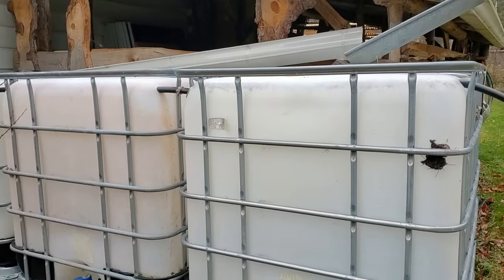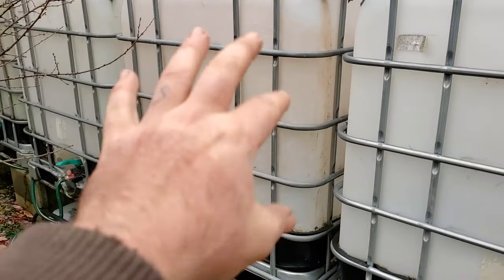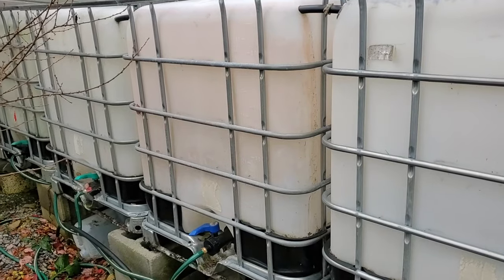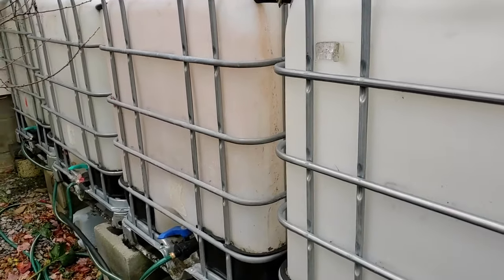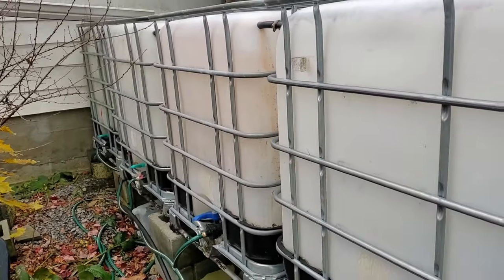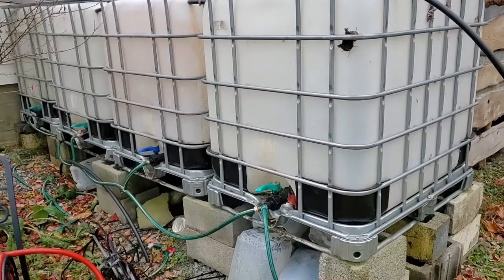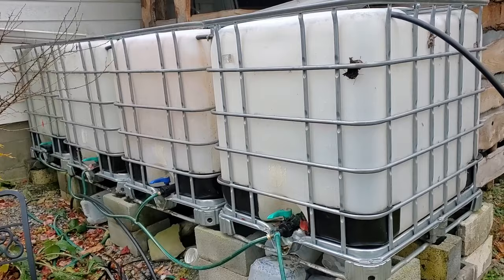We get very cold here. We do not want to have water stored in these cisterns. They can technically take being filled with water and freezing solid and not necessarily be killed — I've seen that happen, I've made that happen unfortunately. It swells the metal. Sometimes they break at the bottom, sometimes not. It's very risky in a cold climate. You really do want them drained.